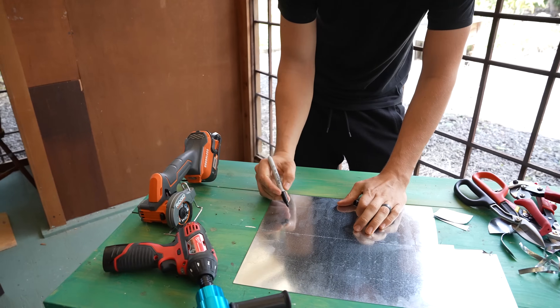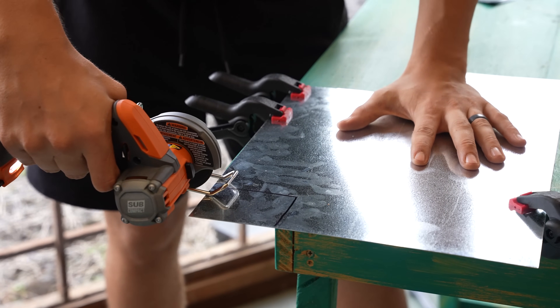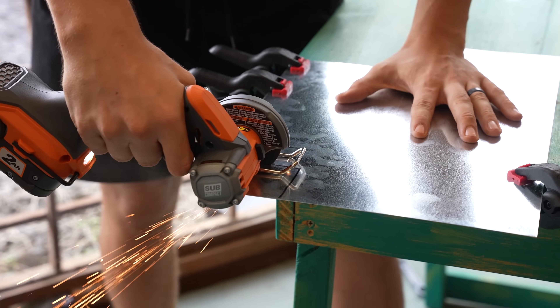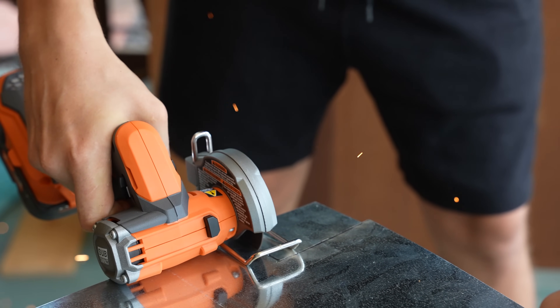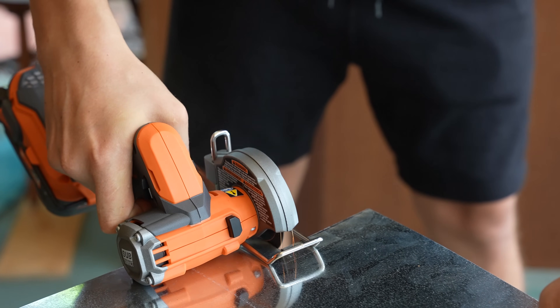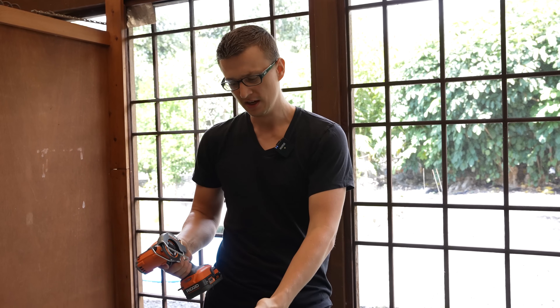Let's do a quick example of the grinder — cut out a little square like this. When using a grinder, do be cautious. Sometimes it can kick back; as I was cutting that first piece it did kick back a little bit, so you have to watch out for that. If possible, wear some kind of eye protection from the sparks that are flying out. I really should be wearing some gloves — sheet metal can cut you real quick. So when you're cutting a lot of sheet metal, I would definitely recommend wearing some gloves.